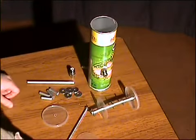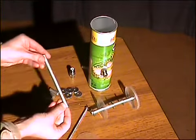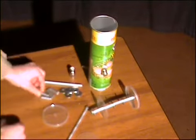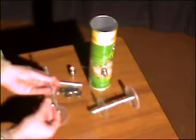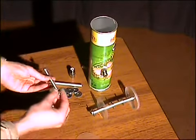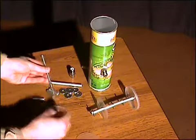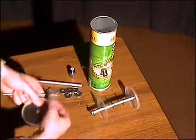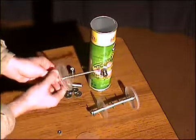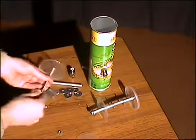To do that, we need to cut the aluminium tubing into 4 equal pieces of about 1.2 inches, as seen here. And then you need to cut the all thread to exactly 5 5/8 of an inch long. Next, we'll cut holes in the Pringles lid itself so that the all thread passes through it. And then we'll start putting the pieces on.